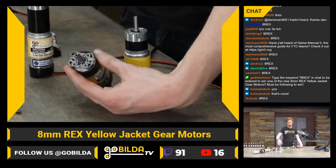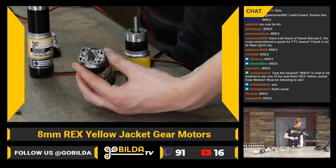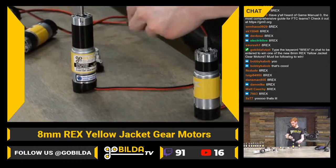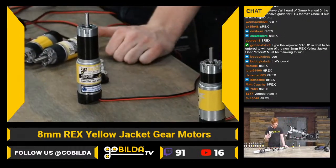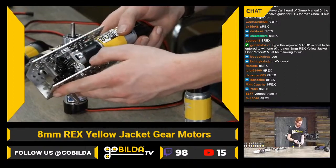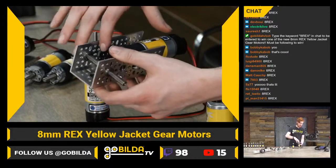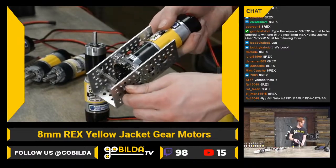There are other small features: you can now run a bearing in an adjacent hole with 14 millimeters of clearance. The collar clearance also goes the other direction — if you've got a six millimeter set screw collar, you can rotate the motor 90 degrees and those will clear, which is great for a four-motor-into-one-shaft approach. This also works great in our miter gear setups. Here's an all-8rex miter gear setup with thrust bearings — this is the exact assembly shown in the product insight on the product page, and it is crazy smooth.